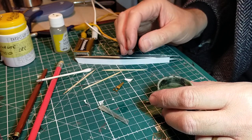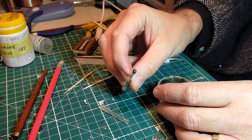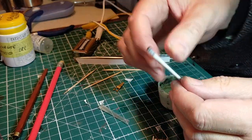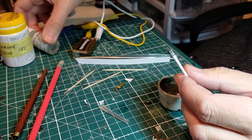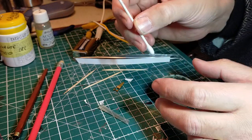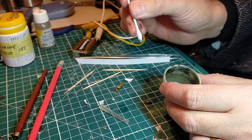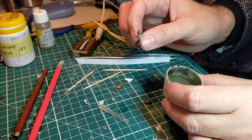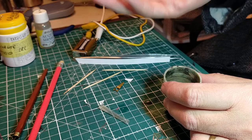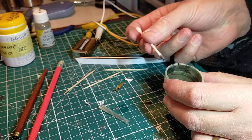And now we'll have a look at the brush holders, the brushes, and the bin. Of course, the brushes release dust, sorry, not dirt, and a clean commutator is better. These kind of motors tend to accumulate less dirt compared to others, the ring field ones, at least in my experience. And generally, if they work, you notice a motor that has a dirty commutator. But with some contact spray, you just go in, and that gives them a good clean.